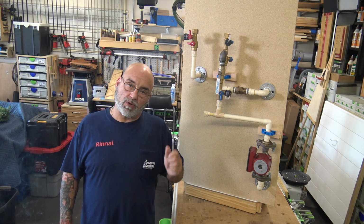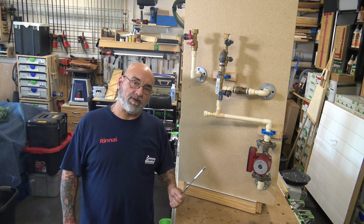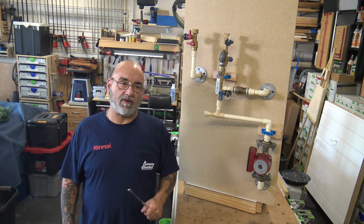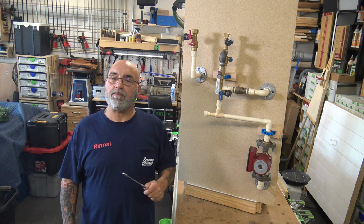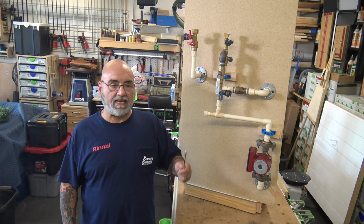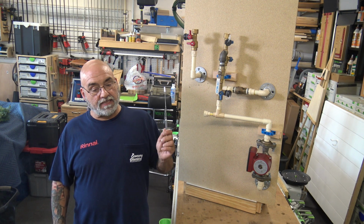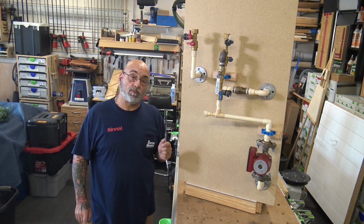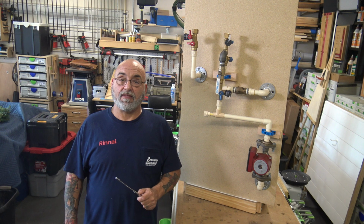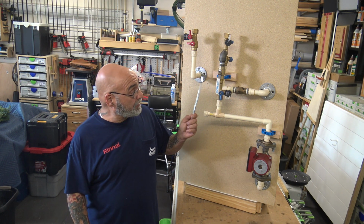And the Rheem rep would call me up and say, hey Mike, can you go down and look at this brand new tankless in this brand new home? It's malfunctioning. And I would show up there and it was something bad in it, whether the heat exchanger went bad, there was a leak in it, the water servo valve, the PC board, something. But then when the Rinnai rep would call me and I would go down and look at a Rinnai, it was always installer error. Whether the hot and the cold were reversed.